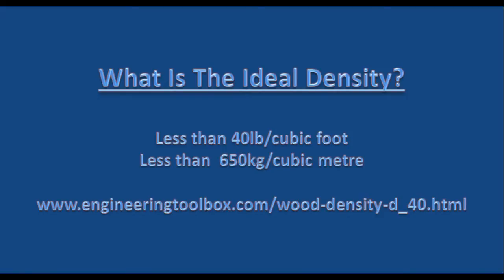So what is the ideal density? Well, there's quite a range. I try and stick with timbers that are less than 40 pounds per cubic foot, or in the metric system, that's 650 kilos per cubic meter. Now, you can go a little bit above that if you want to, but I always find that I get much better results the lower the density of the timber.